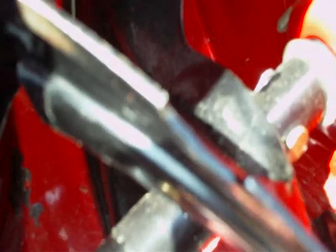I didn't realize that I had a broken shear pin — it was this one right here. These things will break first before any other part. See how they have a notch in them? If you hit a rock or something, they snap. I don't know if I broke something, because we have a paved drive, so I don't see how it could have got rocks in it. They have a little pin that goes in the back of them — maybe that just fell out. These two were jammed together the opposite way. And this little black hole right here — I realized every other year it takes oil. Just take a little oil and squirt some down in there; there's just a little gear in there. It comes from the main shaft over the side. I'll just pop that off with a flat screwdriver and squirt some oil in — I just put a little dirty oil in it.